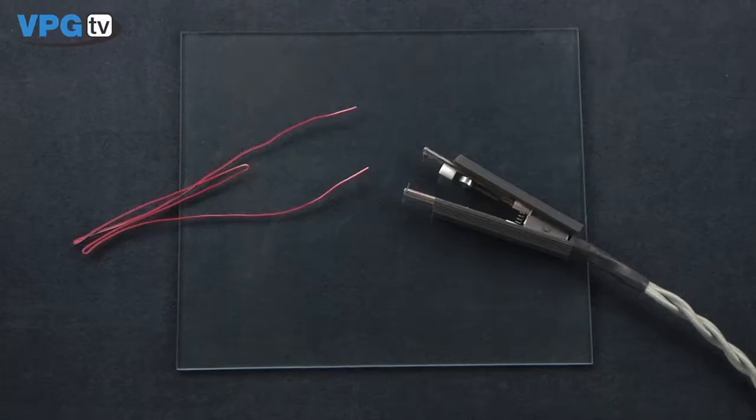First, I will prepare and tin the 3-conductor length of lead wire by stripping, twisting, and tinning. I will use a dental probe to help separate the strands of wire. To better understand the benefits of a 3-lead wire connection to a single strain gauge, see Tech Tip TT612, the 3-wire quarter bridge circuit, in the technical area of our website.